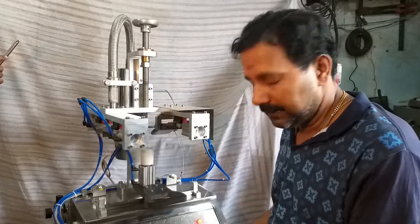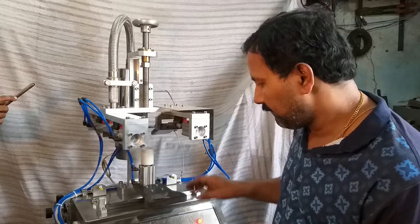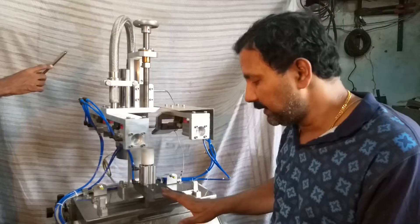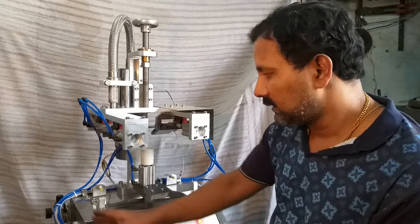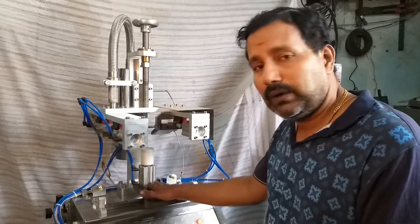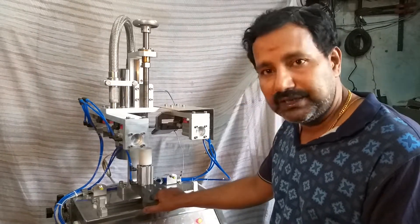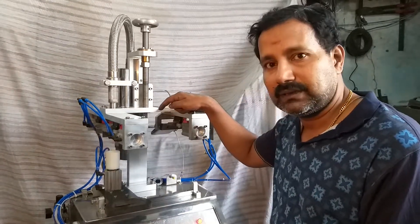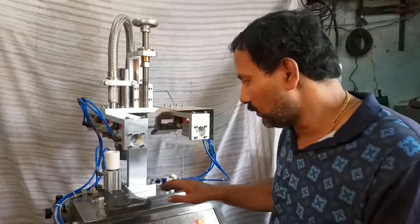When the main power is on, the heater is started and the temperature has to be maintained to 475 degrees. The air connection is made, and the tube holder slide has to be moved manually towards left and right for each operation. The tube is first heated, then the sealing action is done, and simultaneously the batch coding is also performed.